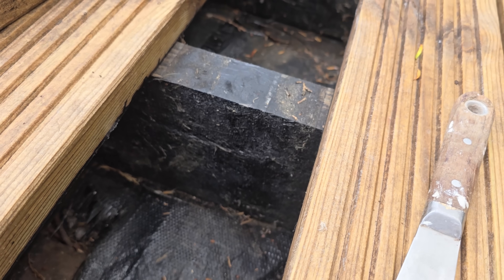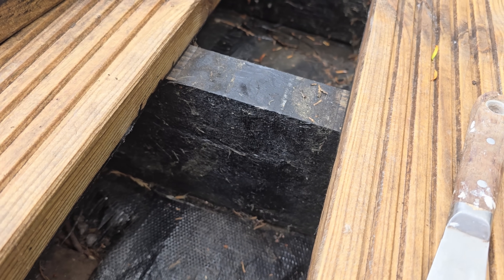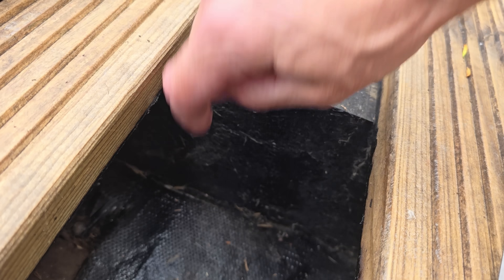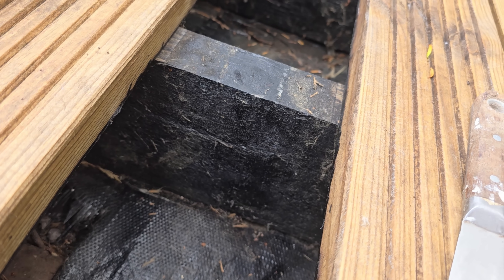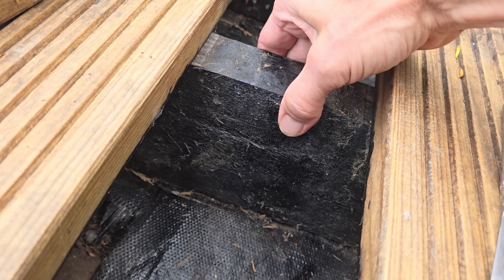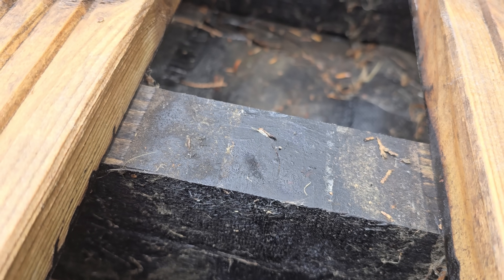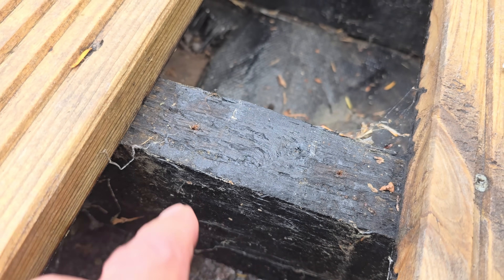You've got the bricks here for the sub-base and you can see where I've slightly crudely slipped a glazing packer underneath to raise the joist off the brick to prevent any damp getting up. The joists themselves — after the event I coated them in bituminous paint. Andy made the point that by casing the entire joist in bituminous paint it can't breathe, but the underside of the joist hasn't been coated. The key point: the joist is looking in really good nick with no sign of any rotting.